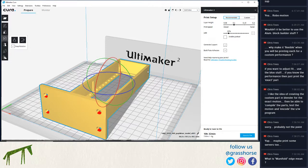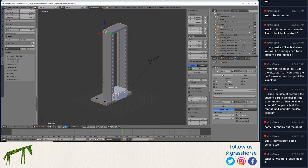What does a non-manifold edge mean? In this case, it has to do with the fact that it was mirrored. It wasn't a complete solid. In Blender's eyes, it wasn't a completely solid object down the center. Now, it was mirrored, so it was manifold, and the edge it was telling us was non-manifold is an edge that we were using to mirror. And if we actually closed that up, it would make the model look incorrect. If we really wanted to get rid of that, we just go back into Blender, and I can hit apply, and it would apply this mirror to it, and that edge would no longer be non-manifold. So, if that answers that.